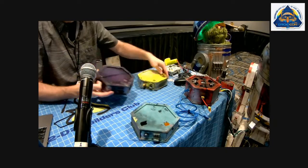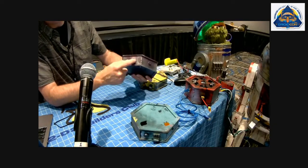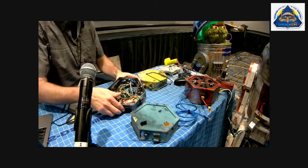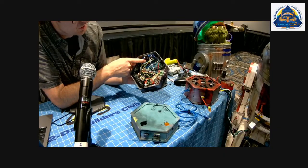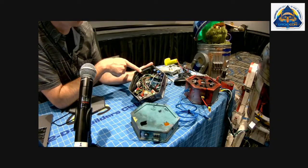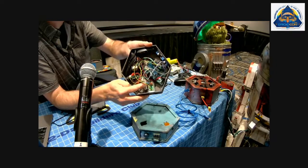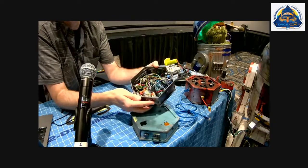So let's open the brain. And so again, this one has power and data, and then power input. And so this is the Padawan system with the Mega, with my soundboard, ground loop, the receiver for the Xbox controller. And then here's the little terminal jack for the Ethernet, which is really handy to do all the signal wires. And that's it. That's all that's in this one.